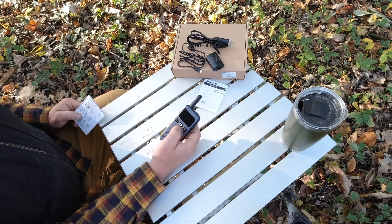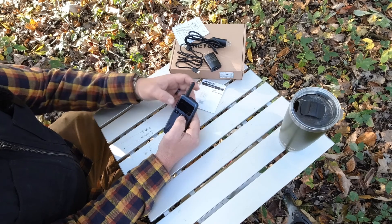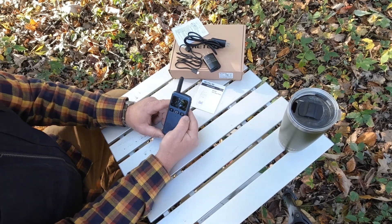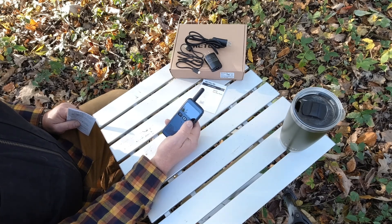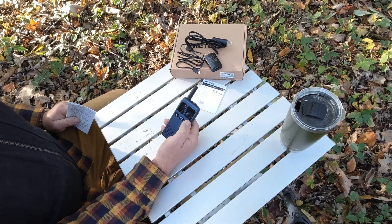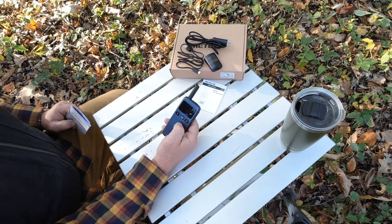To see your current battery level, short press the box button and then short press the power button and it will display the battery indicator on the display. Now, all radios or most radios have a squelch level, which blocks out unwanted noise. But if you thought somebody was talking on the channel with a weak signal, you could monitor the channel. Long press this right button and you hear the static - if someone had a weak signal, you would actually hear them talk.